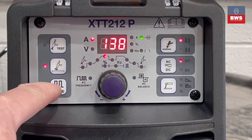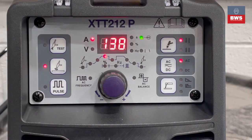Next we have the pulse button. Pulse is generally used for DC, especially when welding stainless steel. Stainless steel has chromium in it, which is what makes it resistant to rust. Unfortunately, when welding, if you get the weld pool too hot it can burn away this chromium, meaning your weld will be unprotected and will eventually rust. We use the pulse to produce a hot pulse then a cold pulse — this hot-cold action enables us to keep the heat down in the weld zone.